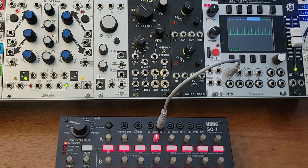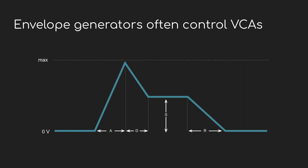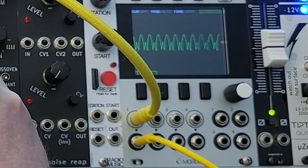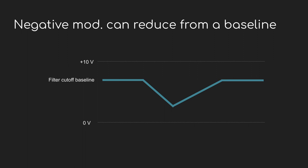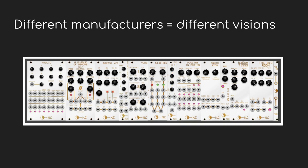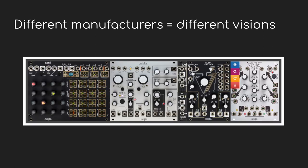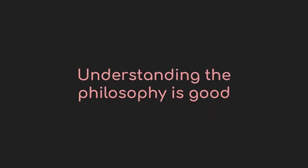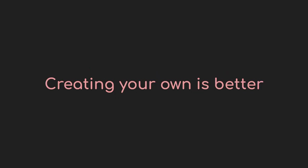Concentrating on those first two, we've got a range of 10 volts — either 0 to 10 or minus 5 to plus 5. The only real difference is that one goes into the negative and the other doesn't, and that's usually for a good reason. A trigger has no need to go negative; for a VCA, negative CV doesn't really mean anything useful. On the other hand, audio sweeps back and forth across positive and negative, and negative modulation can reduce the value of a setting. Most modules start out with the designer building it the way they want it, reflecting their own design philosophy — and I encourage people to think of this as a feature, not a bug.